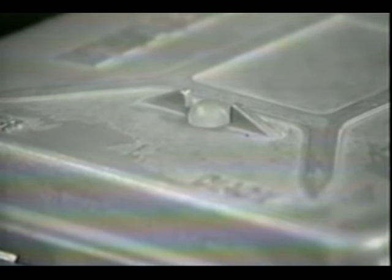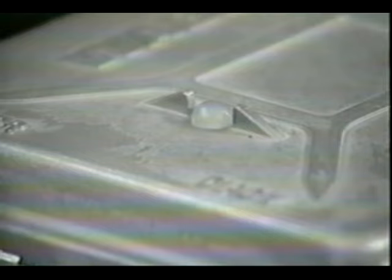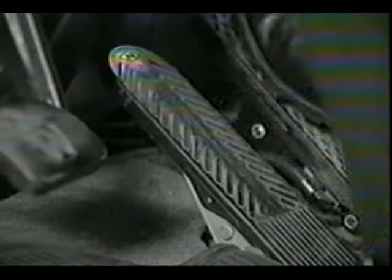All ECU assemblies have an LED mounted to the top cover. This LED blinks active faults continuously, or in sequence if the system is placed in diagnostic mode. To use this LED for reading blink codes, you'll need a mirror, white sheet of paper, or other reflective material to more easily see the LED flash. You can also enter diagnostic mode by powering up the ECU and counting the flashes of the ABS warning lamp on the outside of the trailer.